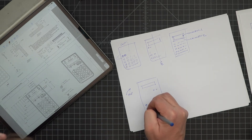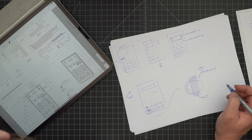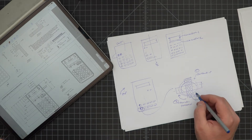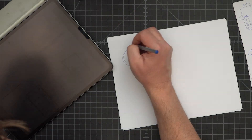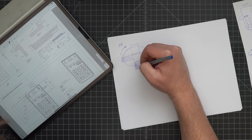Step nine: flip the calculator over and add support ribs around the large buttonhole. I made one strategy for getting those ribs and then realized it would produce the wrong geometry, so I changed it. The strategy is just a plan — it's meant to guide us, but we need to know it might need to change. I realized right there during strategy creation that it needed to change, so I crossed it out. In my revised plan, I would cut one side, use a circular pattern to make two other cuts, do a new cup cut for the wider slot, and then pattern this entire set of operations to all of the large buttonholes on the top cover.